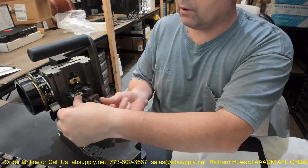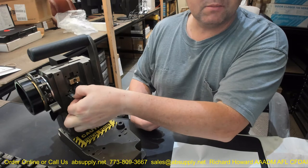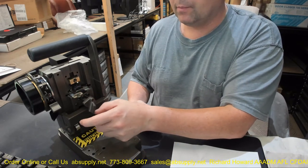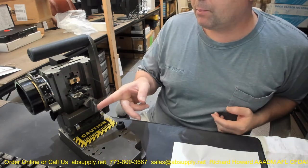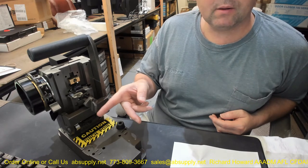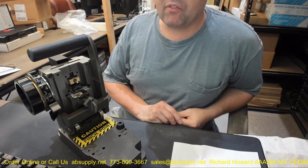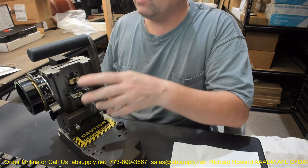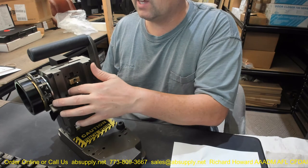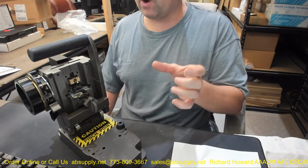I like to hold the key with a finger and rotate — just that small turn. The key is now firmly in the machine. You'll notice the key clamp knob hangs loose at about the 6 o'clock position — that's normal. Leave it; it's good. That behavior is what's different with a non-original key blank — the knob does not act normally. Now you've got the key firmly held in place. Turn the key clamp clockwise to lock the key blank in the key carriage. According to the installation instructions, paragraph 4 of step 1, you're now locked in place.